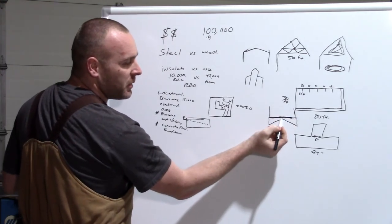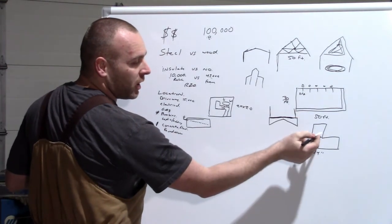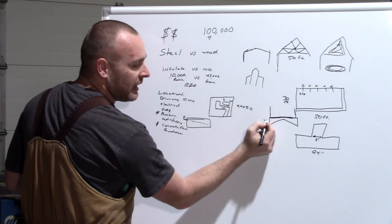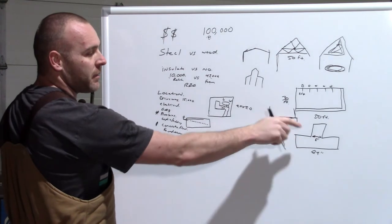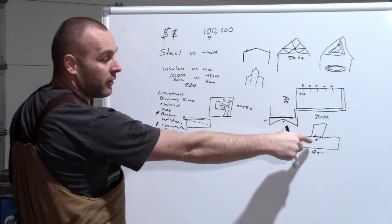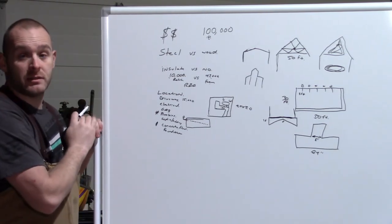And then it's thinner in the middle, which is whatever, your 6 or 8 inches that you decided you're going to build. So instead of putting all the concrete in this type of foundation all the way around, you do the whole entire slab. Out here, this may be 18 inches, so the center is 8 or something. So you're going to use roughly the same amount of concrete, and in my opinion, this will move around a whole lot more than if you set a footing and a wall down like this, 4 feet down into the ground. So there's some other costs there.